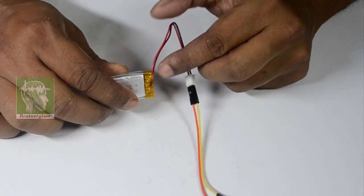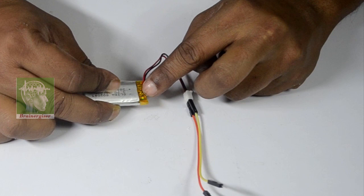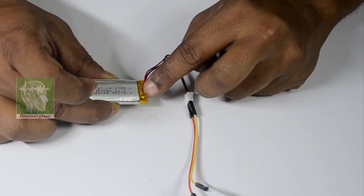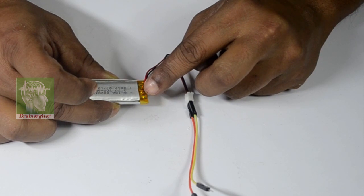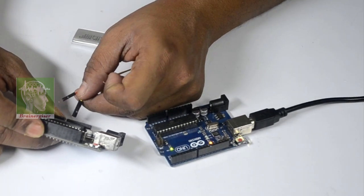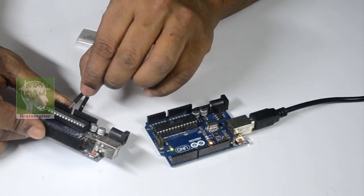This region has a protection circuit. That circuit mainly protects the battery from over-discharge — if the voltage drops below 2.7 volts, it will disconnect from the circuit. Now let's connect this LiPo battery at V-in and see what happens.